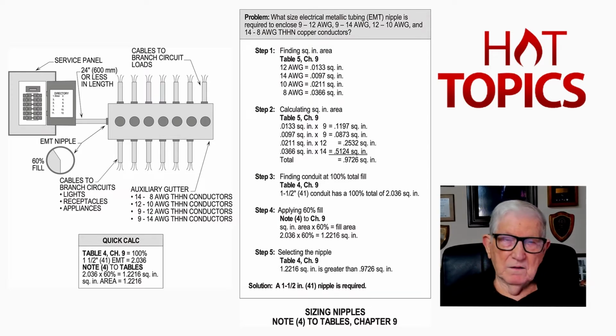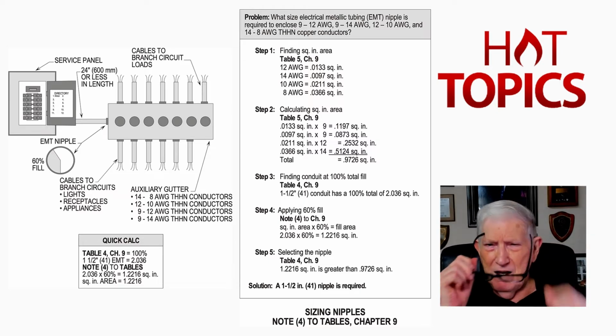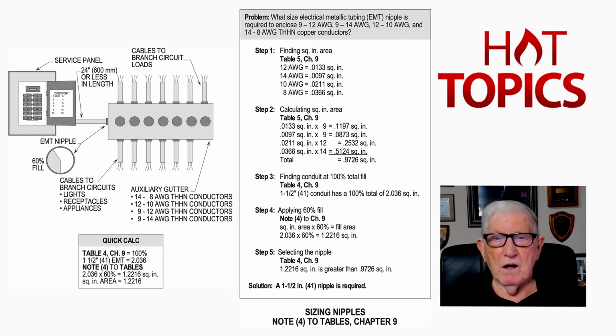Now, notice you don't have to derate now for the number of current carrying conductors. So now, kind of keeping that in mind, we can now go to our Figure 12-23 in Stallcup's Electrical Design Book, Volume 1. And notice we have a little problem here. We have, notice, a 60% fill. Now, we've talked about that. As long as that's 2 foot or less in length, we're not bundling in accordance with our 310.15(C)(1) that we looked at.